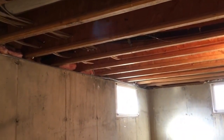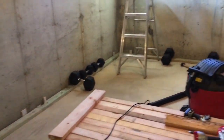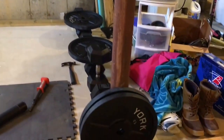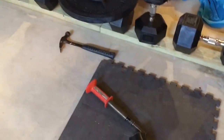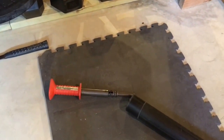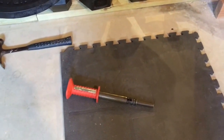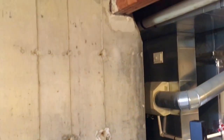Now I'll have a place to attach the wall without that getting in the way, and the ceiling will be nice and clean so I can put up sheetrock or a drop ceiling. Here are more floor plates with a lot of weights sitting on top of the pressure-treated 2x4s to hold them down. Here's the gun for the concrete nails - it's pretty simple. You put a nail in the front, load it with a .22 caliber blank - just gunpowder - give it a good whack with a hammer and it nails right into the concrete.